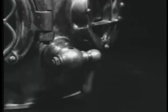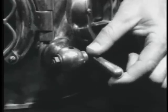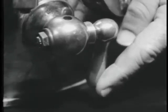This valve is not a cure-all, but it does help eliminate the possibility of blowing up. On the left side of the helmet is an auxiliary relief valve, or spitcock, which is open when the valve handle is in the horizontal position and closed in the vertical. This is an added safety factor. Its chief use occurs when the diver is working on his right side and so is not obtaining maximum benefit from his regulating exhaust valve. It also permits minor changes of buoyancy without changing the setting of the main exhaust valve.